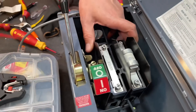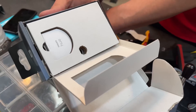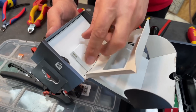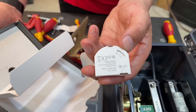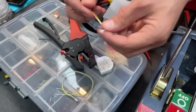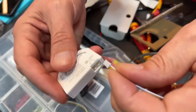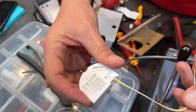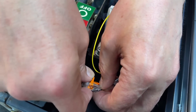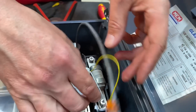Here's the secret: this is the Philips Hue wall switch module. It's designed to keep smart lights working in the event of a switch being switched off — essentially you take the switch out of circuit to keep power to smart lights. But it also enables you to convert any switch to a wireless remote, and that's what we're doing here. It's dead easy — there are two inputs into this wall switch module. Just plug in the little wiring loom that comes with it. That's why we needed the converter from the big wires to the small wires, because they are quite thin. They're not actually switching anything — they're just sensing whether the switch is open or closed.